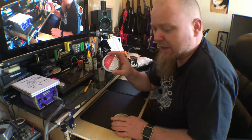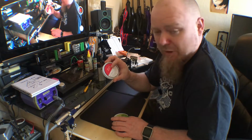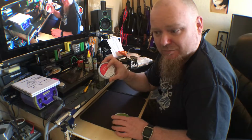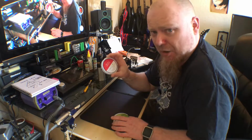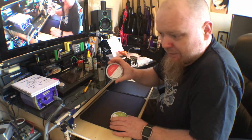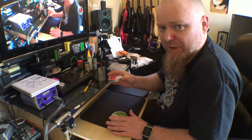Ni80, the 80 basically says it's 80% nickel, but the other 20% is chromium, which seals any potential gases from escaping when nickel gets too hot. Chromium counteracts that and stops that happening. So nichrome is good to use. You can get Ni90, which has a higher percentage of nickel in, but it's still got that chromium in there to stop it from becoming dangerous.